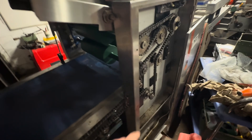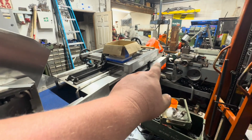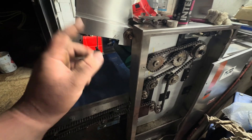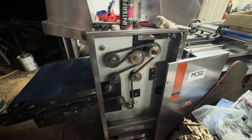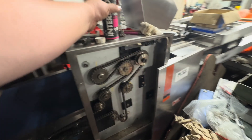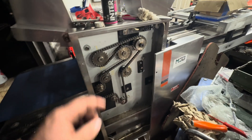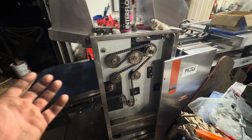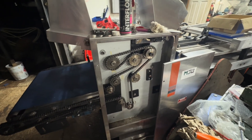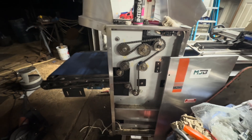The original coating on the rollers had failed and they'd gone rusty. The shaft that runs through the machine to the motor has been repaired. We've had new hanging bearings for the belt, two new belts for the motor and pulley, and a new Tsubaki chain which is a very high quality Japanese chain. We've lubricated all the chain and sprockets with Interflon food lube - fantastic stuff for chains as it doesn't attract dust from dough, which kills a chain very quickly.